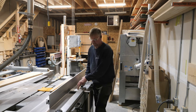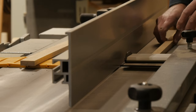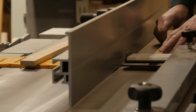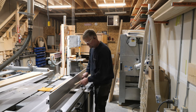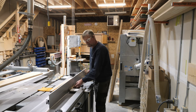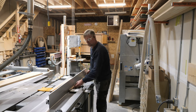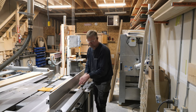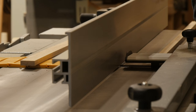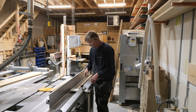I've now got this guard set right down on the material. When I push the piece in, it is actually pushing the guard up slightly. If I put that down a little bit more, that's perfect — so I might actually have to lift it up, but it's now just got pressure down on the material, which is going to help hold that material down flat.